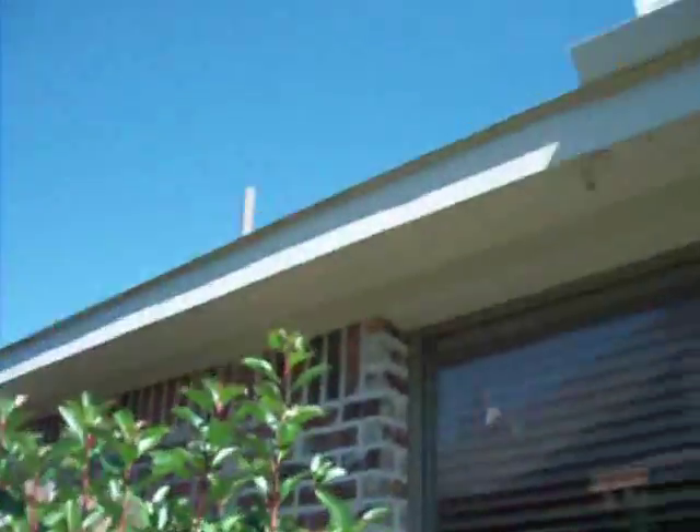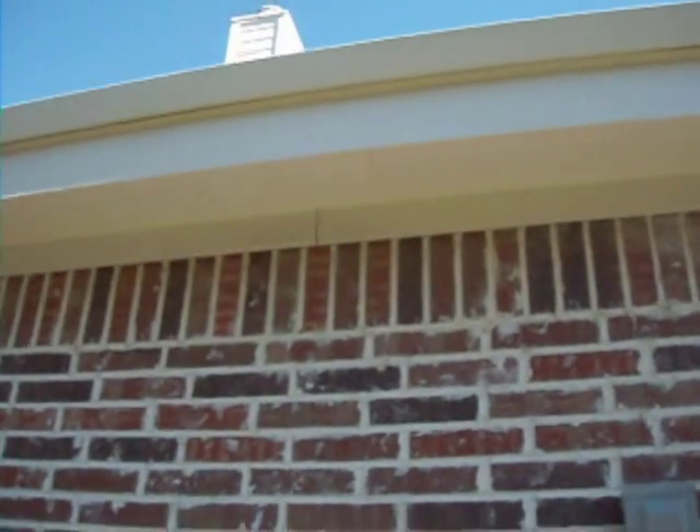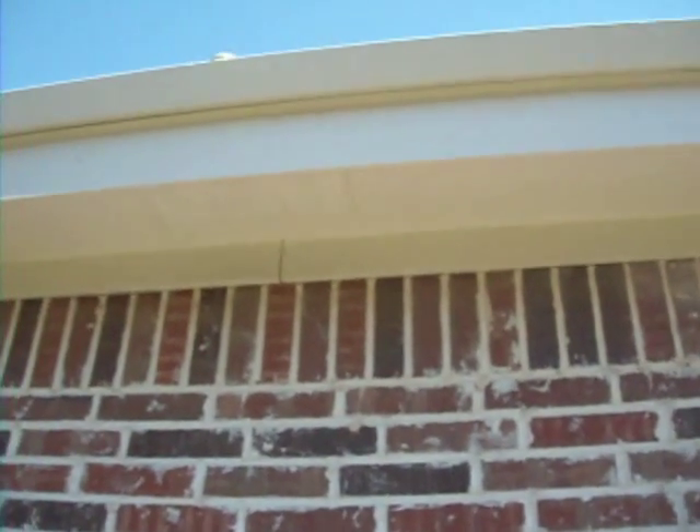This is the wall inspection. What we're looking for is cracks in the walls around the windows that indicate foundation settlement. I've measured the foundation internally and that's all looking good. But there is a little bit of settlement here — you can see the frieze board has got a crack in it, caused by the building just moving a little bit.